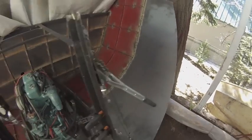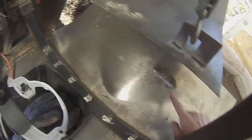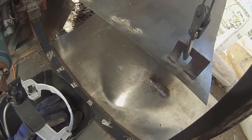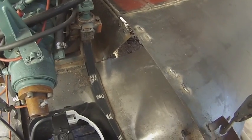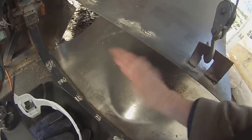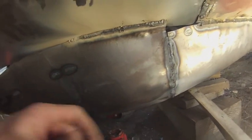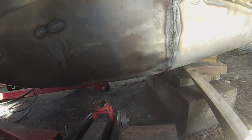This sheet curved real nicely, so I was thinking maybe I'm getting better at this — but then I totally mangled this one. I've got a crease here. Somehow it creased over here instead of below it; I'm not sure why it would do that. I still can't predict what the metal is going to do. My problem is I've got a compound curve — it's starting low here, coming up here, and I'm also trying to bend it this way. Here's what it looks like on the outside. It's a lot better than it used to be, not anywhere near perfect, but I'll work on that with smaller hammers later on.